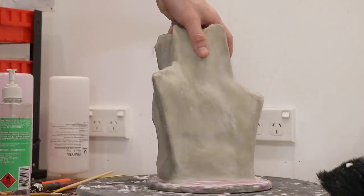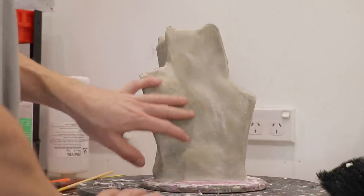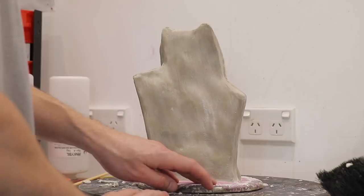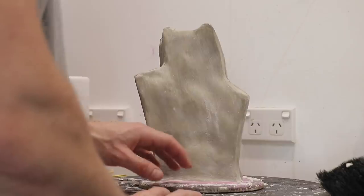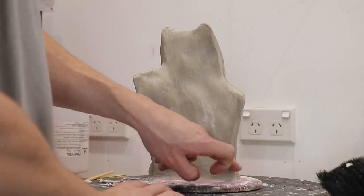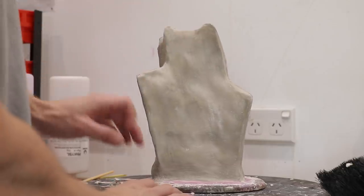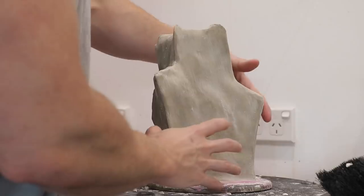All right, geeks, the mother mold is fully cured, fully completed. I let this baby sit overnight. Granted, you know, I could have probably demolded it an hour later after I applied the final panel, but it was pretty late at night and we still do have to go in with an angle grinder and grind all the edges here to make them all nice and neat. And that is also gonna help the mother mold actually release and crack away.